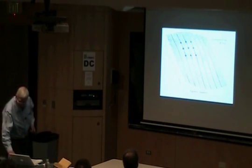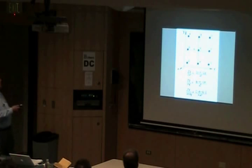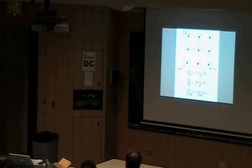You take those errors, and I've identified them by letters, A, B, C, D, E, F, G, H, I, and you do a little calculation from those letters. You know, subtract them and all, and delta is just the width between those two. You divide by that. What you get is second derivatives, partial derivatives of that surface for x and y and diagonal. What the diagonal does is to tell you how much cylindrical power you've got that's going diagonally that doesn't show in the other 2 terms.